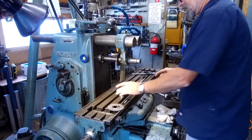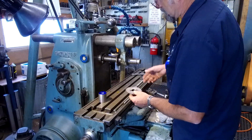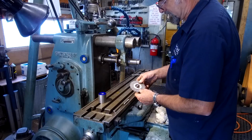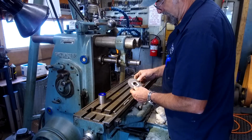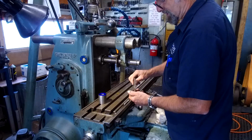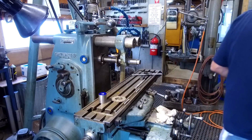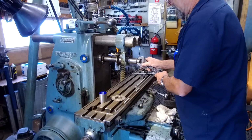All right. We're going to let that dry while we're changing cutters. We're going to use this arbor, 1¼ wheel cutter arbor, and we were cutting a keyway in a shaft not too long ago, and while the arbor's in here, we're just going to change out the cutter. This cutter is 150 thousandths or so thick. I wish I had one a little thinner, but I don't. With the stagger tooth, that's what I favor in here.